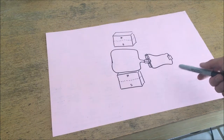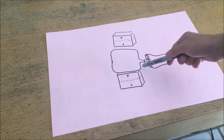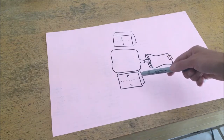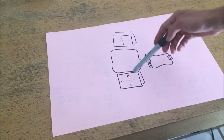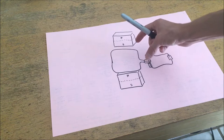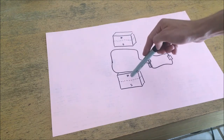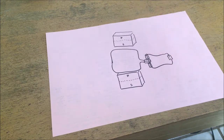On the most fundamental level a DC motor is nothing more than a loop of current-carrying wire on a rotor. This rotor has two brushes making contact with it, and two sources of magnetic field — in this case permanent magnets — situated surrounding this coil. When this coil's surface where the magnetic flux develops is perpendicular to the position of the magnets, it's going to tend to orient itself so that the magnetic flux is parallel to the magnets.